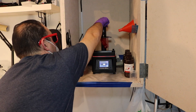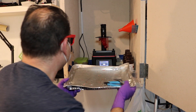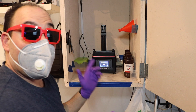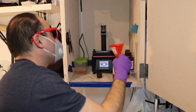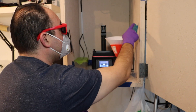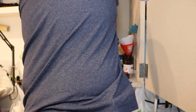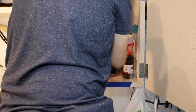Got my gloves on. Unscrew the build plate right up top, I've got a little dollar store tray with my tools on it. Take it off and put it off to the side. Now we're going to take the resin bottle, open it up, take a little funnel — I got that at the dollar store — grab a filter. I found these at Harbor Freight, 100 for five bucks. I 3D printed a little filter holder. I'm going to take the resin out — there's a little notch, that's where you want to pour it. Pour it right into the funnel.